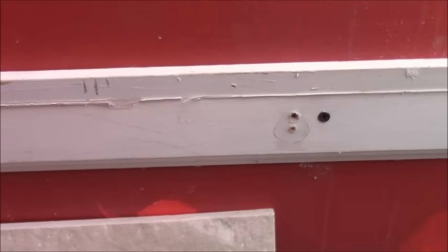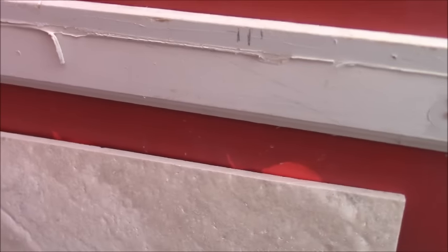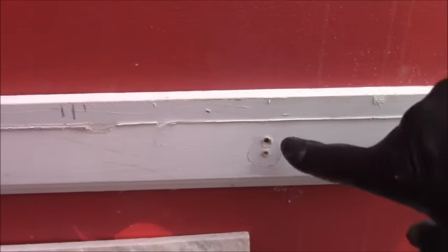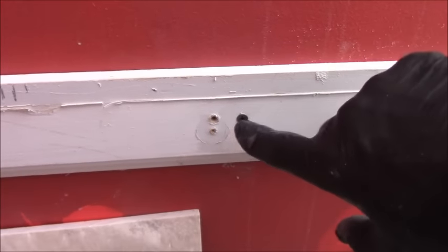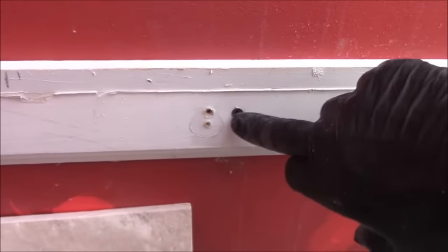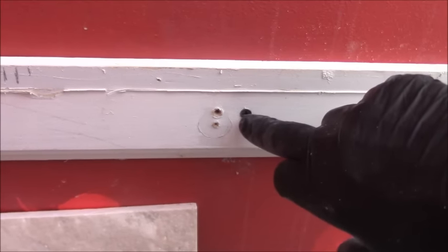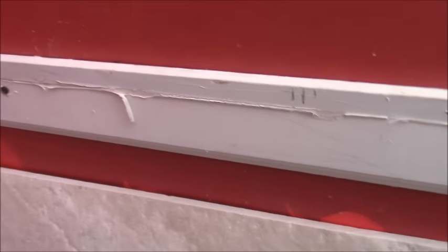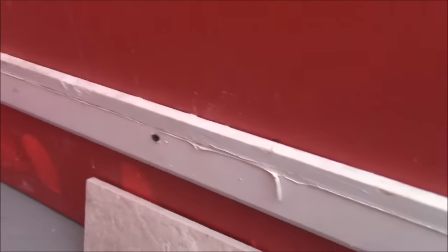And as I said again, to reiterate, once you take off the screws, and you're going to minimize how many screws you use, in this case, I have 4 of them going across. I have a 5-foot span, so you're not going to put a whole bunch of screws in there. But once you take the ledger board off, then you go ahead and put silicone inside there, or put some thin set inside there, and let that dry out best you can, and put some Redgard on top of it, just so that you don't have penetration through your waterproofing. And that's as simple as it gets.